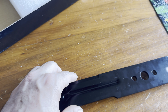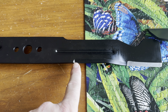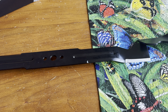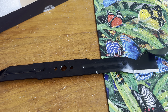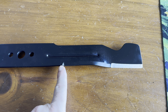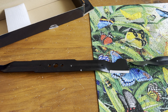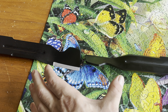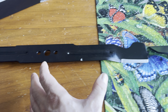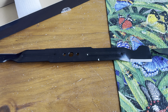I know it because that section is not sharp at all. If this is the correct design of their blades, then in my opinion this should be sharp all the way through, even though it's raised. You would still have an uneven cut, which is the other thing I've been noticing — I've had to go over some areas a couple of times where I'm not getting an even cut, like a three-inch gap. Well, that explains it right there. The dull side is raised and the actual sharp side is up at the tip. So I'm thinking what they've done is — yes, you've got a 42-inch cut advertised, but I think they're really only cutting a portion of the grass and folding the rest, with some cutting happening at the very ends.